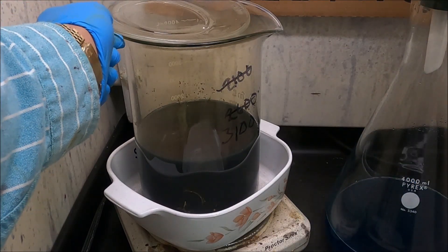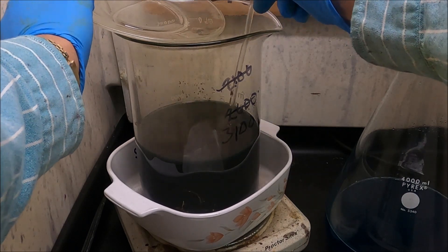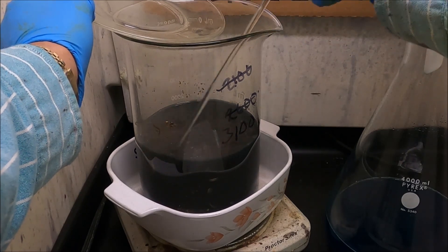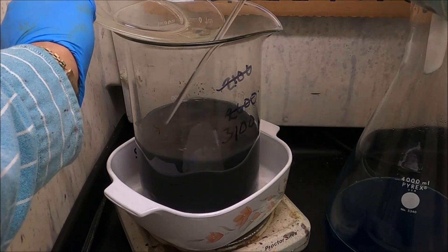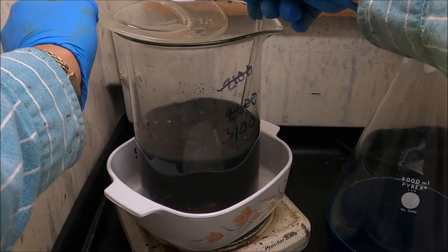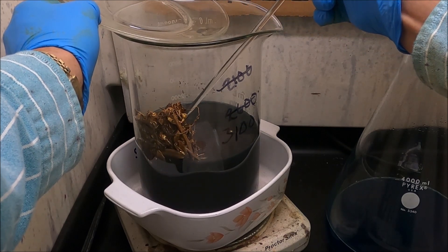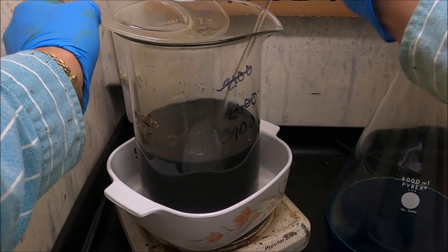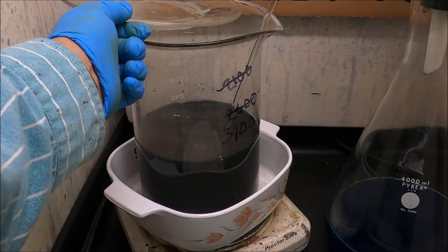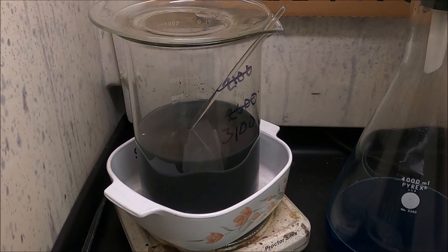I'm going to keep boiling here until I don't get any fume production in there. The last thing we need to do is call this thing too early and commit to putting these foils in aqua regia too soon, before all of the base metals and other material soluble in nitric acid has been removed. I'm just not going to do that — I'm going to take my time with this. This is a large batch and I do not want to be lured into making a premature decision to go to aqua regia. Right now it's about 7:30 and I've been working on this a little over 13 hours. We're just going to leave this boiling until I don't get any more fumes.